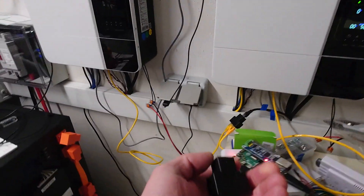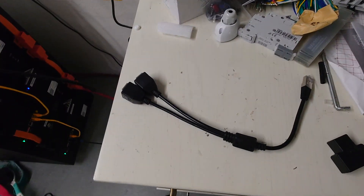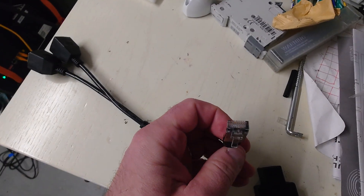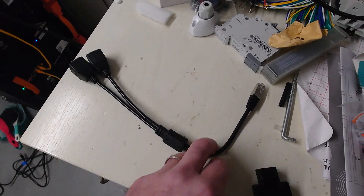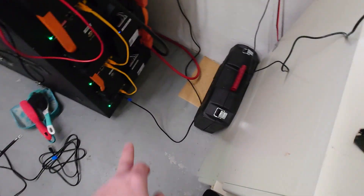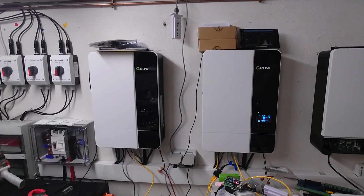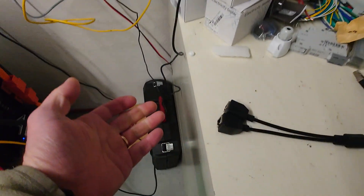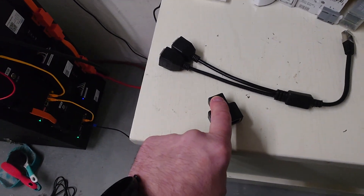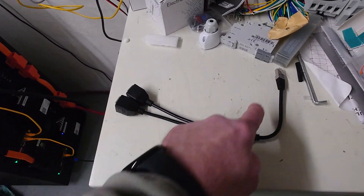The other adapter works a little differently: you plug it into the battery CANBUS port, and on its two output ports you use specially prepared communication cables to your inverters. I think this solution is better because you only need one customized cable and two standard cables. But the other version also works great.